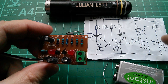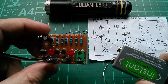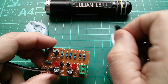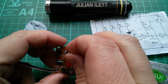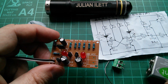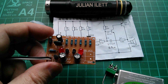Yes, it'll be a bit louder and it might also change the frequency characteristics a little bit. But this battery is fairly high resistance and it's also probably a bit flat, so I think it'll be absolutely fine. And this capacitor I'm not going to solder in initially — I'll probably just place it in there and see if by wobbling it around I can get it to make contact. I'm just interested to see what the effect of that capacitor not being in the feedback loop actually has.